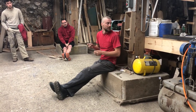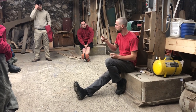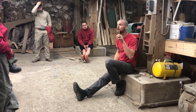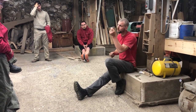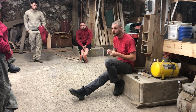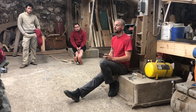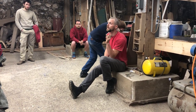A crude way of telling the difference is putting these against a magnet. Stainless with more ferrous iron, like 304 or 308, has a low magnetic capacity. 316L is essentially non-magnetic. So that's a crude way of telling the gradient. You're balancing corrosion resistance versus strength and expense. 316L fasteners are harder to find and generally more expensive.